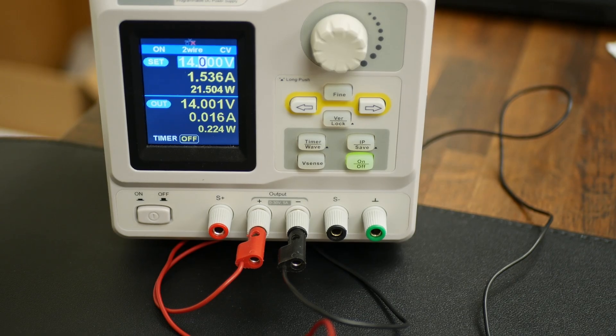At this point you have your senders and you know which gauge you're interfacing to — you may even have the old ones pulled out. While it may be tempting to simply install the senders per the installation manual, there is one more step that saves everyone time and energy. Most repair stations have a power supply that can output 9 to 28 volts DC. If this is not an option, you will need a spare battery — anything that can supply 9 to 28 volts DC.